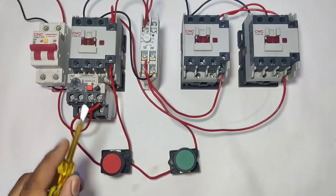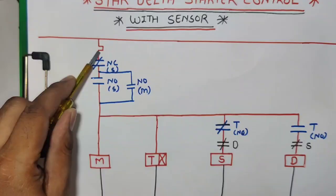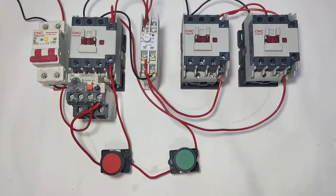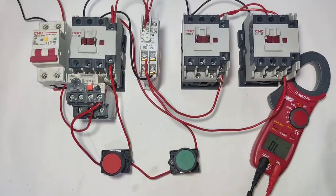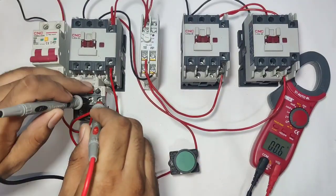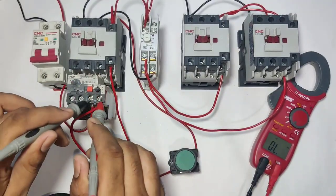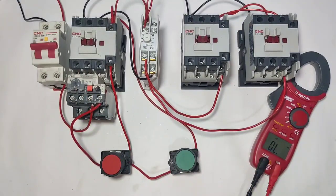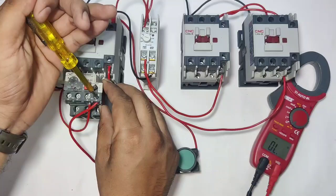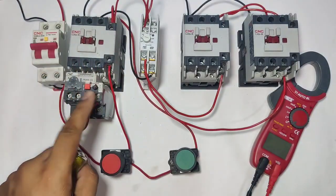After checking contactors, now need to check control wiring. First, check the overload relay, because the line wire first connects in the overload relay NC point. If you have a multimeter, stop the power supply and set continuity range. If your overload relay is okay, it will show a beep sound. If your overload relay is tripped, no sound will show and it will show open. You can also check with a tester: power on, check tester at the 95 terminal — it should glow — and at 96 because it is NC, in normal condition the tester should glow.